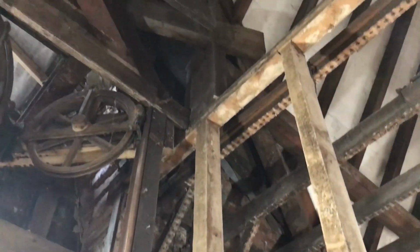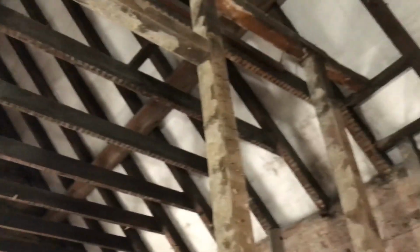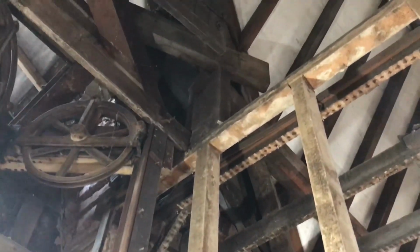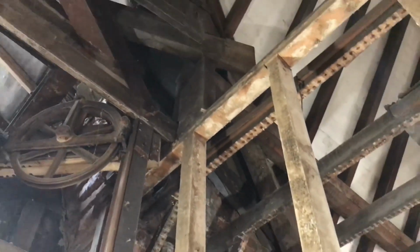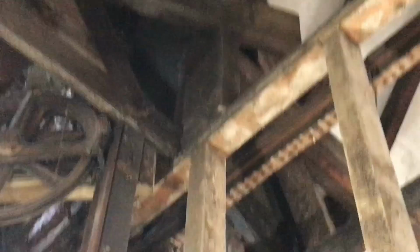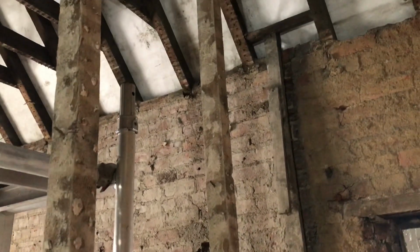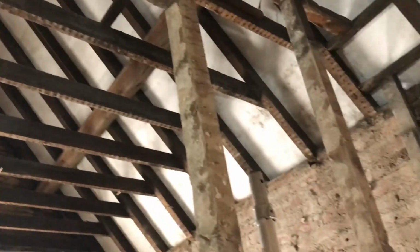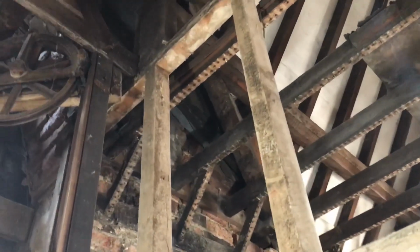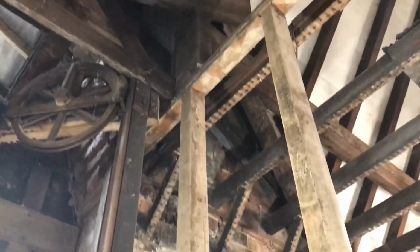Right, today's project is to put this steel across here to support this purlin. It's hard to see because I'm not timbering it away, because it's sat on that stool, which is sat on this stud wall. So, padstone in there, padstone in there, steel across, and then a purlin packer built up to support all that, and then take all this timber out.